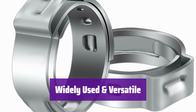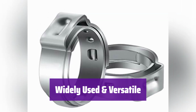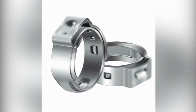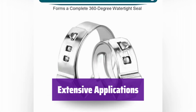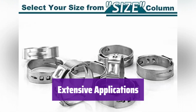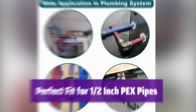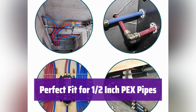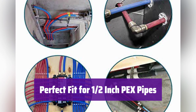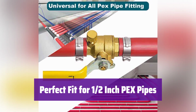They are compatible with all major brands of crimp PEX fittings. They are suitable for various applications, making them incredibly versatile. Use them in hydronic heating systems, air conditioning systems, water heaters, and more. They provide a strong and reliable connection every time. These clamps are specifically designed for 1/2-inch, 17.5 mm, PEX pipes. Ensure a precise and secure fit for your project.